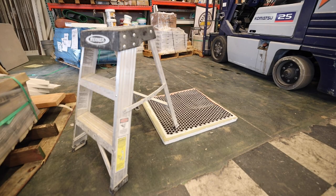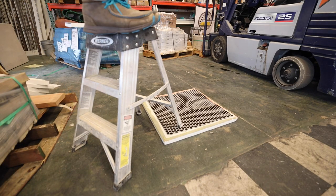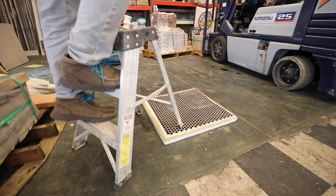Let's do some more real-world situations that might happen and could lead to issues with these foam shower pans. The step stool experiment is a good trial because it's very plausible that somebody will have a ladder in a shower. If we're talking about point load distribution, you have four legs on a ladder, and say a 320-pound man gets in there — that's plausible. There's going to be about 80 pounds coming down on one small leg of the ladder, so 80 pounds per square inch. The compressive strength of the foam itself is 60 pounds per square inch, which would definitely damage the foam.